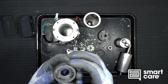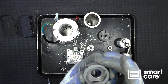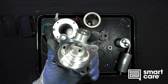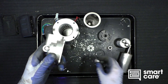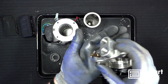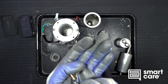This whole sandwich would start to stack up. If we line up our slots, you can see the openings where the different flow path would allow fluid in and then force it back out again. It looks like this is going to be the relief valve assembly. I imagine this is the high pressure port and the relief valve is back in here, and this is the bleed-back from the relief valve if it were to open. We've got a nice seal on that with the acorn nut. This is the adjustment for the relief valve — I'm sure it's a spring. Yeah, there's a little plunger assembly, a spring, and a tensioning nut that goes in to adjust the pressure.